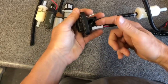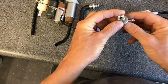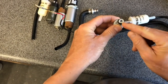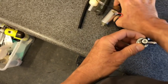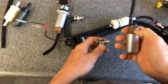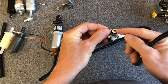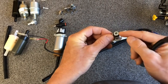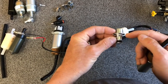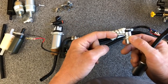Up here at the top we have this cavity where I've taken out the pressure regulator. Very simple operation — it's just like a thermostat. Unregulated pressure from the pump: here's a stock fuel pump. This pump puts out about 100 PSI; the bike needs about 50. We drop it in half here at the pressure regulator. There is a spring inside holding a check valve being pressed against the inlet side. 100 PSI is presented at that, and the spring is regulated so that it lets 50 PSI through.